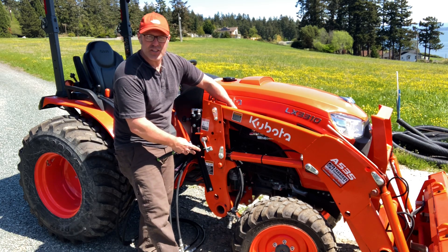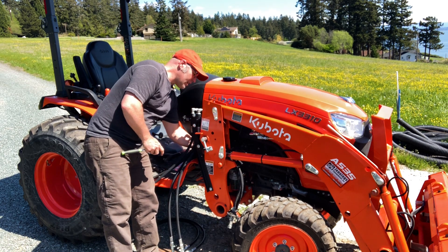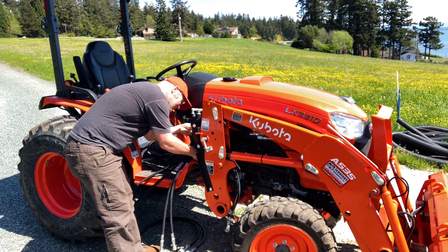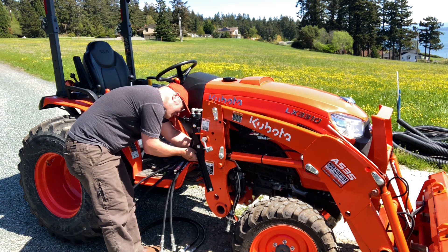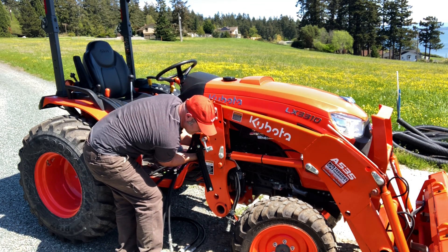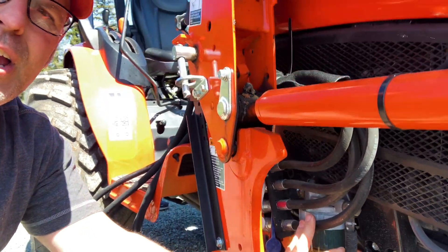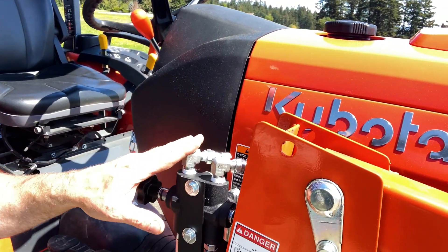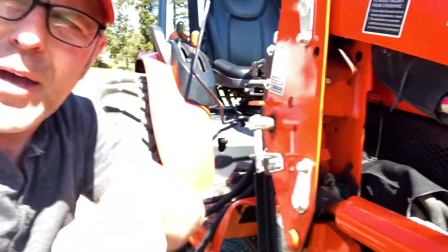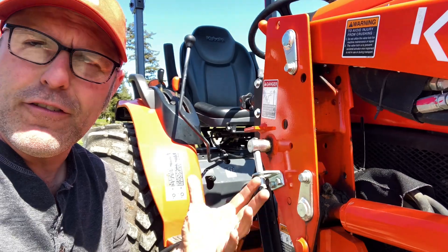Quick couplers are disconnected, and I'm trying to get these hoses out so I can stretch them straight to remove this sleeve, but there is a solid hose keeper back here that I need to release. All I need to do is disconnect two of these quick couplers under here to your loader and connect them up here to the switching valve. All of these loader hoses are in the same sleeve, so back here there's a zip tie. I'm going to need to undo that zip tie. I'm going to take all four couplers off and stretch this hose out, take the sleeve off of two hoses.